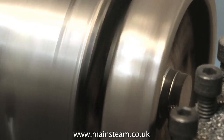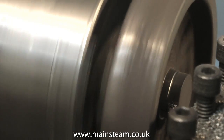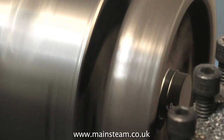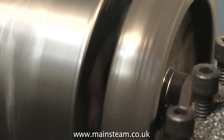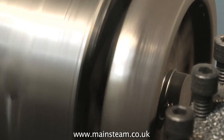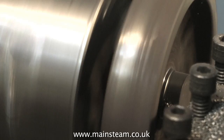I'll discuss chilling first. A chilled casting is when the casting is cooled too quickly, and the chilled part becomes rock hard — and I mean really hard. Almost impossible — in fact completely impossible — to cut with a lathe tool, even a carbide tip lathe tool. It would just skate over the top of it.